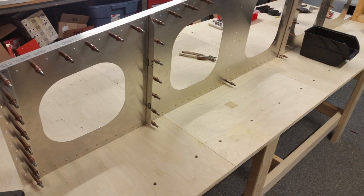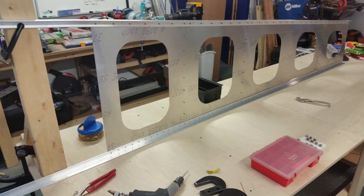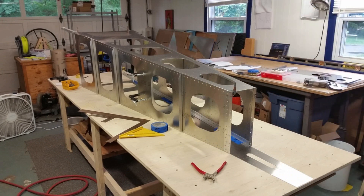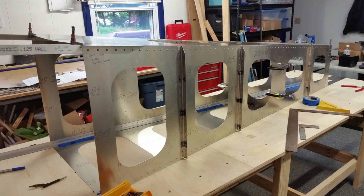The finishing kit will include the cowling, fiberglass fairings, the landing gear, the canopy, and lots of little details. You're going to provide all these elements — customers don't have to go out and fabricate the metal into shapes. Probably 90% of the metal will be pre-formed. All the ribs and skin panels are going to be drilled out and cut to size — pre-matched holes already done. That makes building a lot easier. It's called precision hole matching, and that's very helpful.